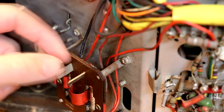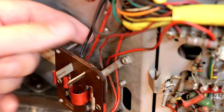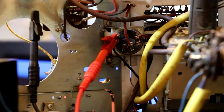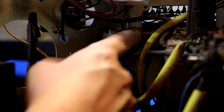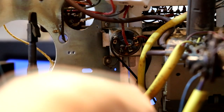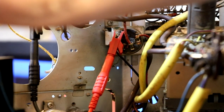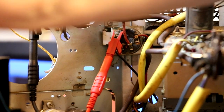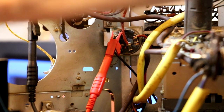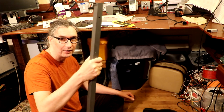Looking at the wire, it looks as though it's almost been snipped through. I can see the black neutral wire - it looks like there was a pair of side cutters on it. It looks like two wires - one has clearly been cut. I wonder if there was an across-the-mains capacitor there. A couple of wires have been cut and this black one has almost been snipped off entirely. The first thing we're going to have to repair is the mains power switch - it's driven from a long linkage to the front of the set and it's very intermittent. We've confirmed this is a live chassis set.